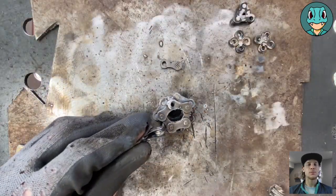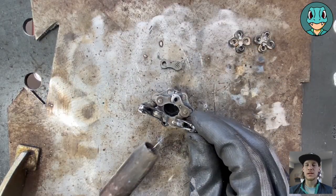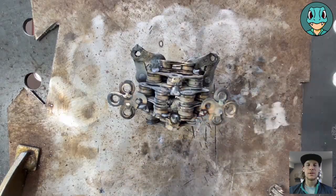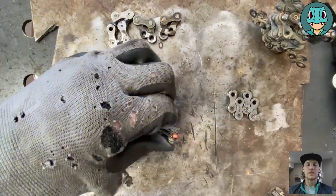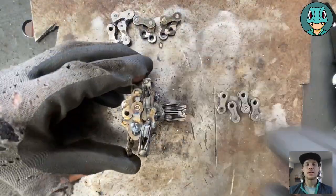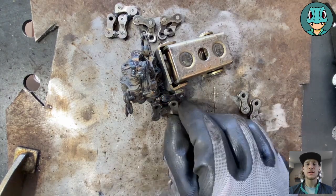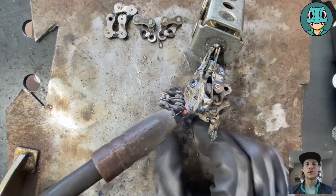And then an additional single piece is going to be used on the top after the ears get put on. These two ears, again, are overlapping three links, and there's that single piece that's going to top it out. So you can see where Sprigatito gets his nice round head with those flat link crosses for the facial fluff. For the body here, we're going to tack either end just to keep it together, and then we're going to add the head on and try to hide that weld sort of on the back of the head. We use a magnet to keep it in place so that we can add the different legs onto each side and keep it pretty level so that when it stands up, it's not falling over.